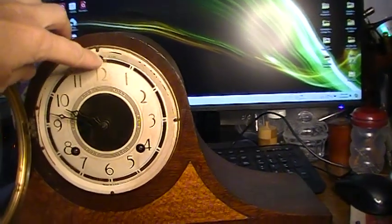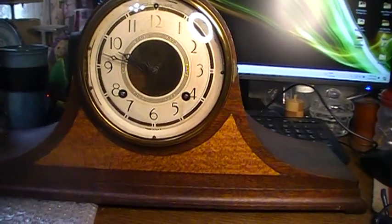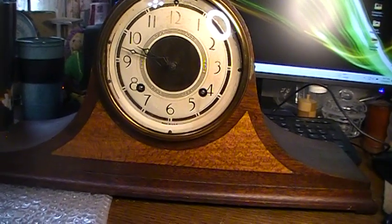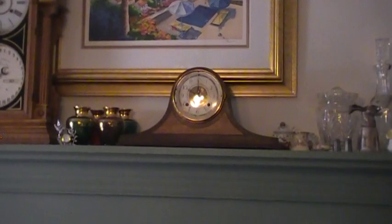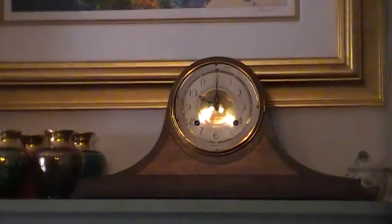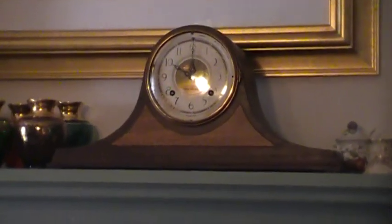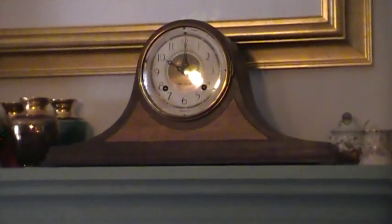There's a little keyhole right here for adjusting that. The pendulum bob is a little more labor intensive — you have to take it off and there's a screw on the back that slides the pendulum up and down. I put it kind of in the middle where it looked like there was a mark from where it had been used previously. This project hopefully is all done. I put it here on the mantel for a temporary home — the strike went off on its own for the first time in a million years, gongs sound good. They were frozen up solid and wouldn't move. This is its temporary home for a while till it goes up for auction. Thanks for watching.